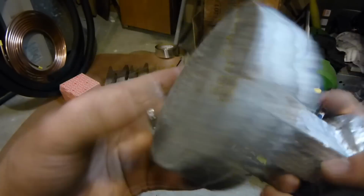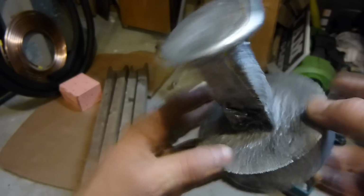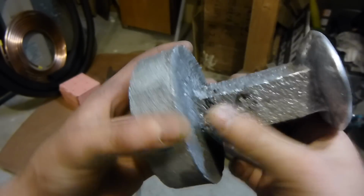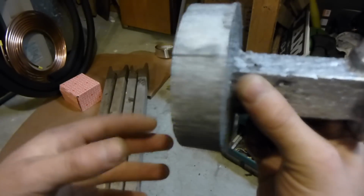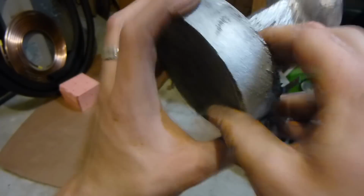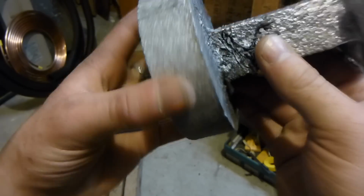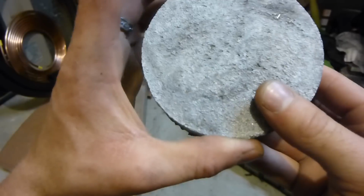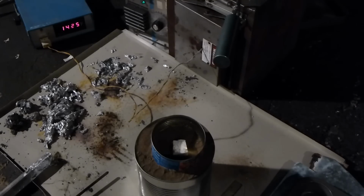I'm not sure on that, but it's decently heavy. I made the sprue so big because I could chuck that into the lathe, and that would also be where I'd put my set screw to hold it on the shaft, because this is going to be a flywheel. But I think I could probably work around it, and it should still be fun to machine. All right, so now we're going to do the cube, which is going to be the machinist's cube, hopefully.